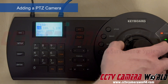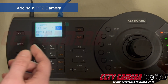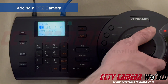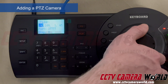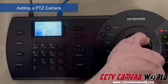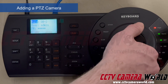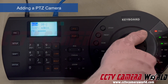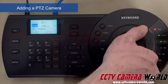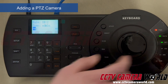I go down to the IP address. My camera is on 192.168.1.45, so I enter that IP address — make sure you enter the current IP address for your PTZ camera or it won't work. The port number is the default, so leave it alone. Step 8 is the default speed setting for the camera, set to maximum speed. We leave the Rule on DH2 — that's the protocol it uses to connect to the camera. We use the admin username and then enter in the password for our camera.